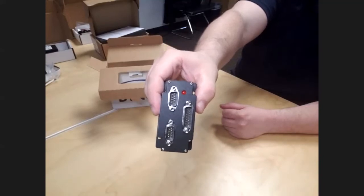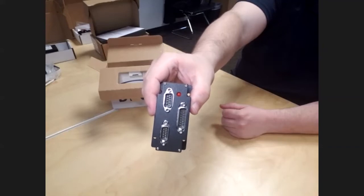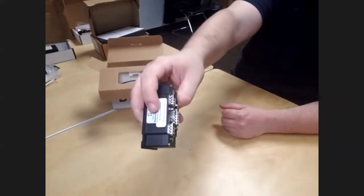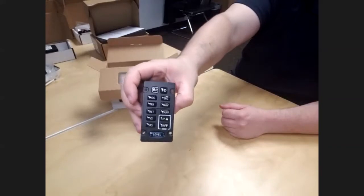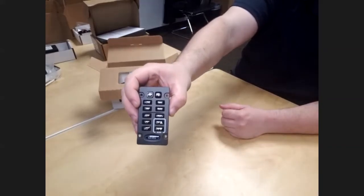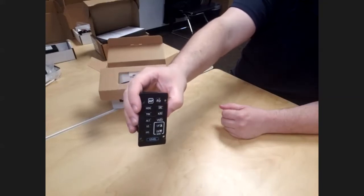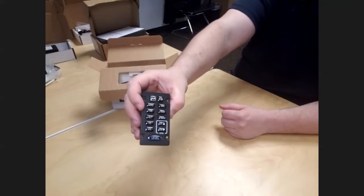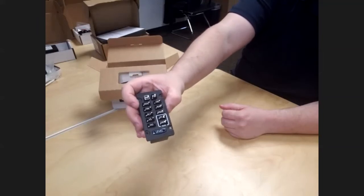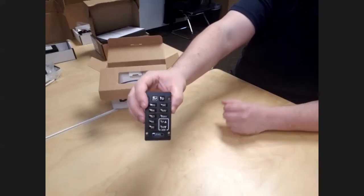It's also kind of, even though it is in the same box, a completely separate subsystem. So let's say your SkyView display failed, you still have trim control of the aircraft. If you don't have this module, but do have autopilot, you don't get the automatic trim, but you still get trim advice from the autopilot because it can sense when the aircraft is out of trim, just like you can. It's sensing residual force on the stick or on the control surfaces, so it'll tell you to trim up or trim down. But if you have that module, it'll just do it for you.